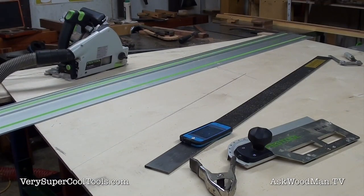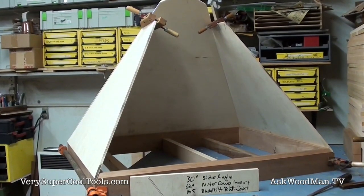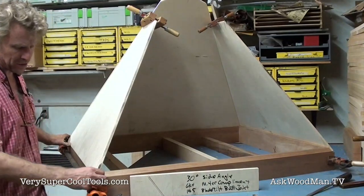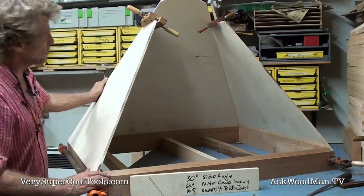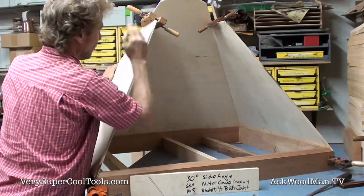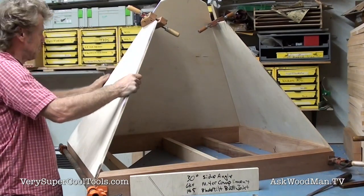This just couldn't be going any better. It's a little tedious to cut these pieces but I think I'm right on with this one as far as length goes — I'm about a fat 16, two millimeters too long on the two ends, but that's okay, I can just take a whisper pass. I was able to get three pieces out of one sheet. I'm going to put cleats on the inside and trim it to make sure it's absolutely perfect, giving me something to glue and screw to so I can pull it into perfect alignment.